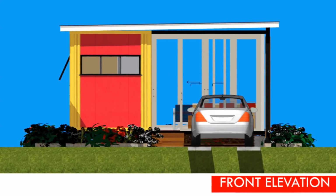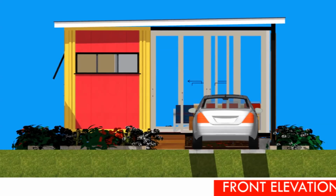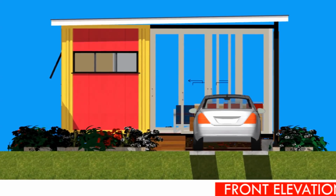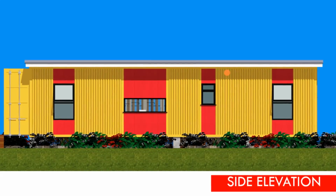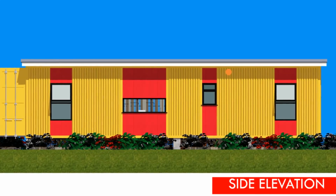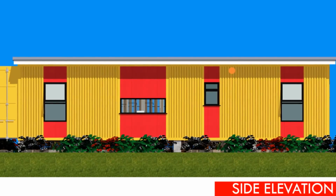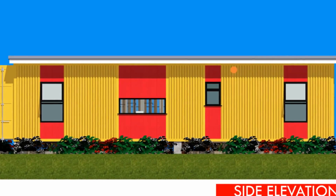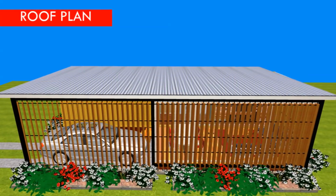If you don't do that, the shipping container house will gather mold, and it will also experience condensation. So to avoid that, you are encouraged to use an insulation material that will give you a good moisture barrier and also good R values. Spray foam insulation will give you the best properties, at least for cold climate regions.